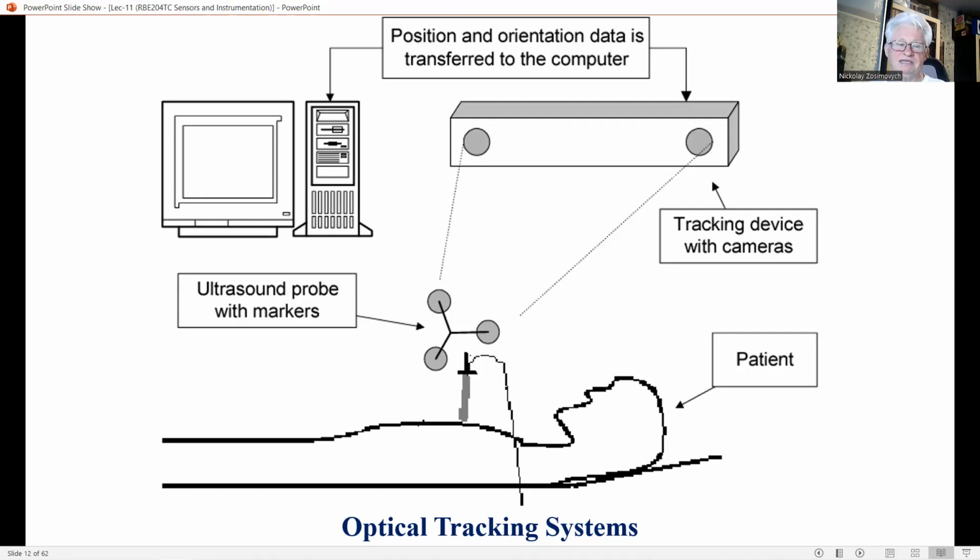Further, there is the choice between direct mode and indirect or reflecting mode. The latter has the advantage that the object to be tracked is completely free from wiring and power sources. Only a distinctive indicator should be present, detectable by the optical system, for instance, a light spot, a light pattern, a black and white marker, a retroreflector, or something similar.